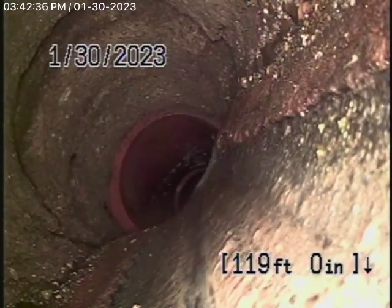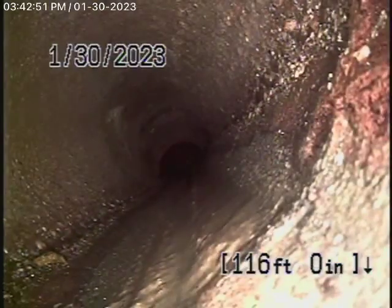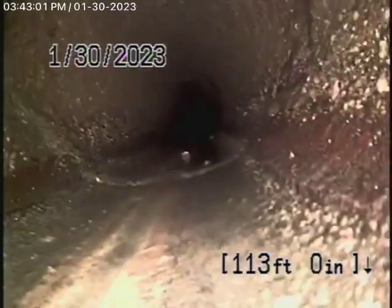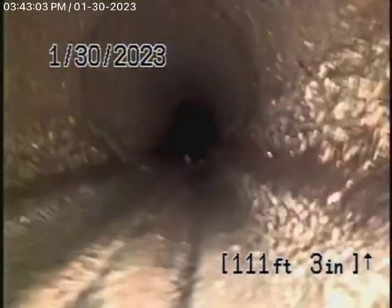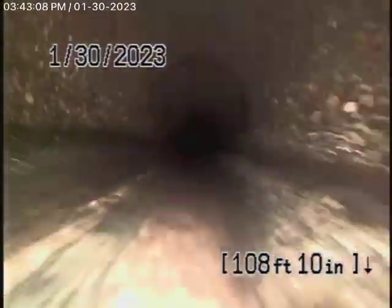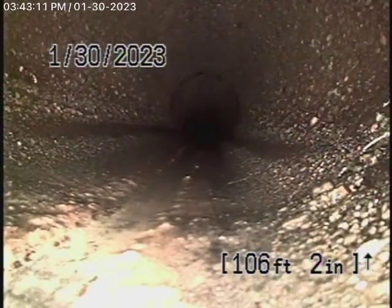I located that in the street. Looking at this, it's difficult to say if it might not be a little bit broken over here, but it's definitely shifted down — the pipe. Let's bring the camera back. It doesn't look very good; it's not really restricting the flow of water, but it looks pretty old. It is a functioning line, but pretty old. That section at the end — I doubt that would ever pass with a public works inspector.